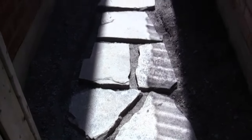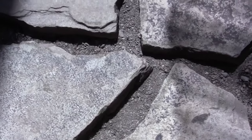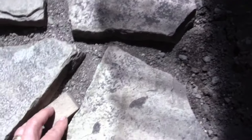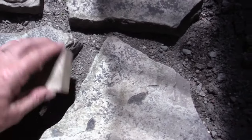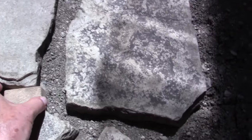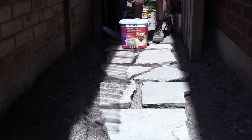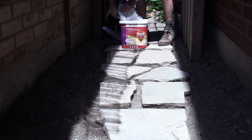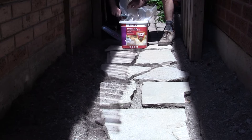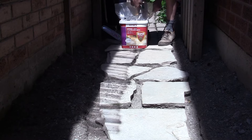Here are the trenches that have been dug out now. Using the one-inch block, I can see I'm more than an inch in some places, and right at an inch in others. Opening the bucket for the first time — cut with scissors. The mortar is vacuum packed, which means once exposed to air the material is activated and the hardening process begins. Don't worry, there's ample time to spread it out.